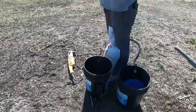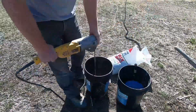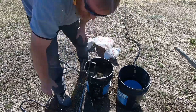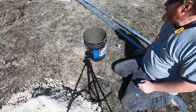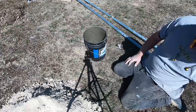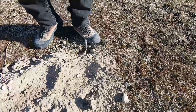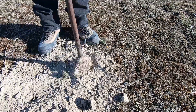Made some bolts with some long rebar welded to them to attach the winch to. Everything was put in the ground with concrete. The dead men themselves — I put two sacks of concrete at the bottom of the hole, put the dead men in, and it was good enough. The dead men themselves were just three-eighths rebar with a welded eye on one end and a J-hook on the bottom to make good purchase into the concrete at the bottom of the hole, with the exception of the winch. The winch I poured concrete all the way to the surface, and the winch was mounted right on the top as well.